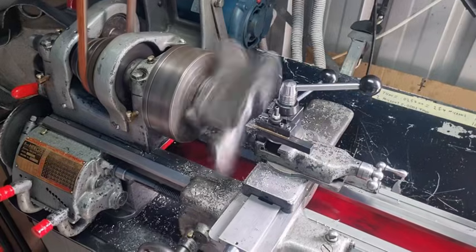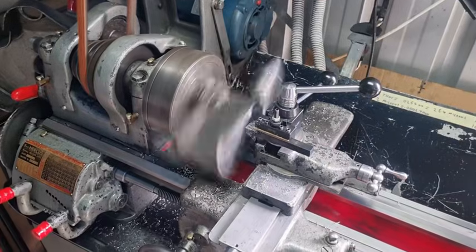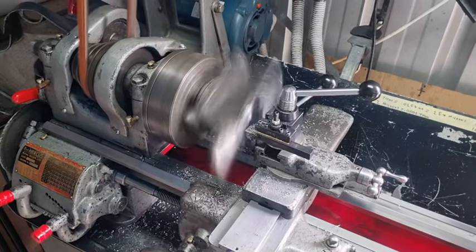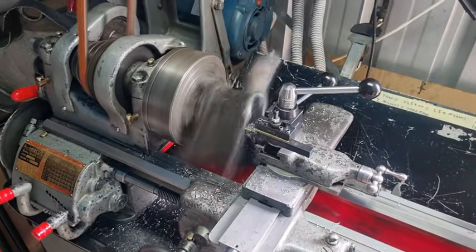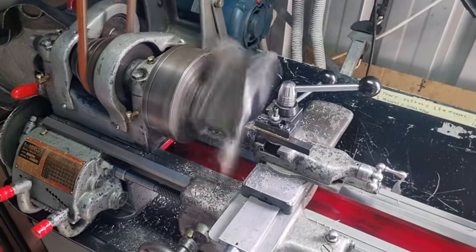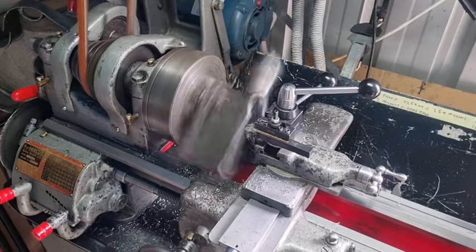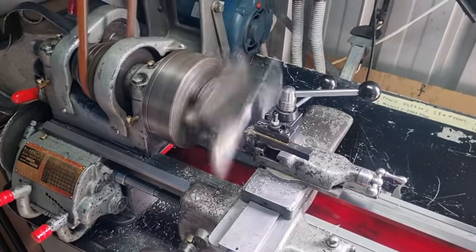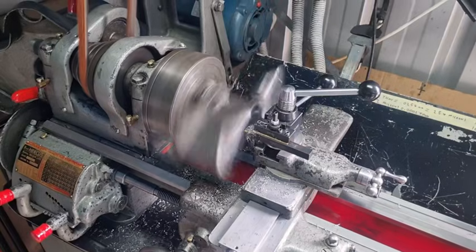It just goes to show you that if you've got a four-jaw chuck, you can turn two of the jaws inwards and two of the jaws outwards so that it can grip lengthways and sideways - because the anvil is a lot longer than wider. You can manipulate the jaws to suit. I've milled quite a few things this way. I've done about 13 roughing cuts because I welded a little piece on the end of the anvil so that I could tap things circular.